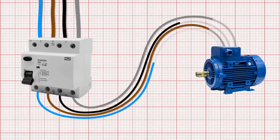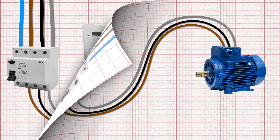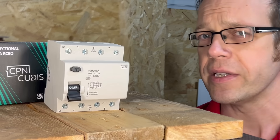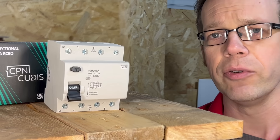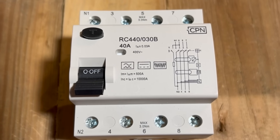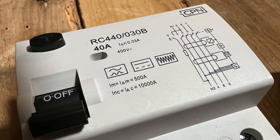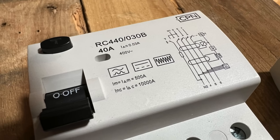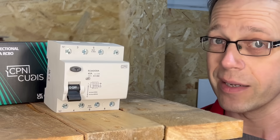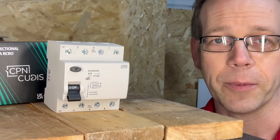In summary, if you're connecting a balanced load, then you don't need a neutral connection to your RCD. If, however, you're connecting up an unbalanced load, then you will need a neutral connection. There is another scenario in which you'd need to connect the circuit neutral to an RCD — that's if you're using a type B RCD to offer protection, because this type of RCD is what's called a voltage-dependent device, and therefore needs the neutral connection as a voltage reference. So, to use a three-phase RCD properly, first check the manufacturer's instructions, think about what type of circuit and load you're connecting, and then connect it up accordingly.